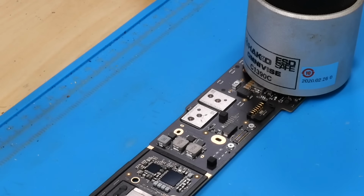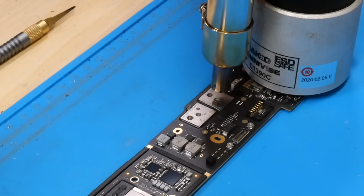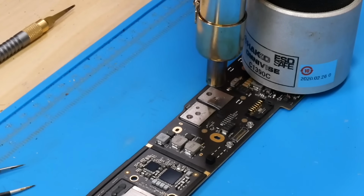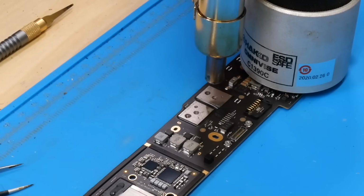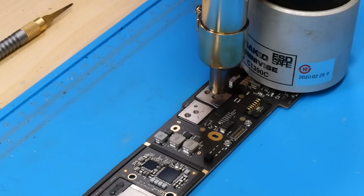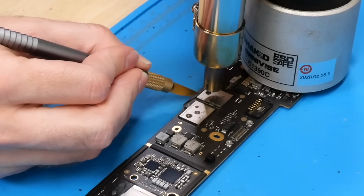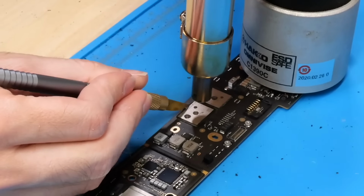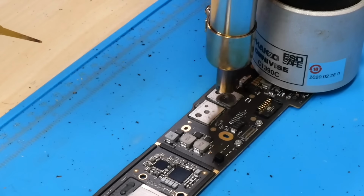Alright, so as with any other NAND removal, the first thing we need to do is of course get rid of the underfill. And I'm not going to go into super in-depth detail on this particular video, but if you do want to see this process in more detail, I will put a link to my NAND upgrading video in the description below, so you can take a look at that and see the process in full detail. But for now, we're just going to get this nice and hot so we can remove the underfill. And with the underfill removed, we'll go ahead and just remove both NANDs.